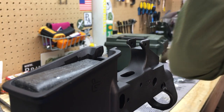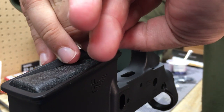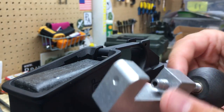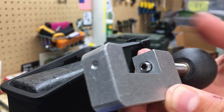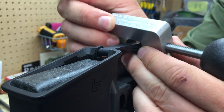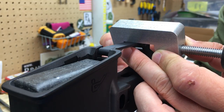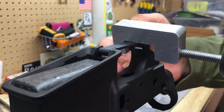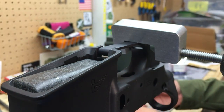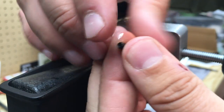I've got my AR-15 lower sitting upside down in the vice in one of the handy Brownells lower receiver vice blocks. I'm going to bring my standard trigger guard to the top and install that little detent front portion of the trigger guard so we have it in there and ready to go. The first thing you want to do is take your roll pin tool and screw it basically all the way out. Then take the longer of the two pins — the one-and-a-quarter-inch — and on the other side we're going to push through the alignment tool. This goes through the trigger guard itself as well as the lower receiver, and it kind of holds itself in there. I'm also going to grab my roll pin and put some oil on it so it has a little less friction going in.